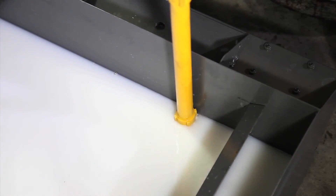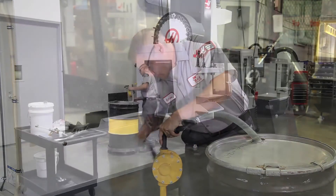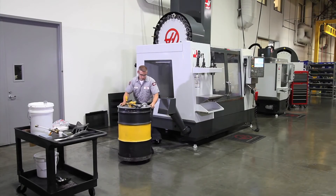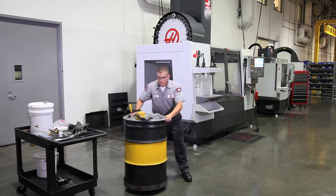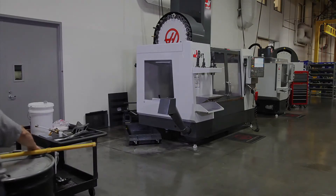Pump out the rinse solution. Your coolant tank and plumbing are now ready to be recharged. Remember, if you keep your coolant tank clean and your coolant chemistry correct, none of this extra work should ever be necessary. Please check out our other coolant videos that deal with making a new charge, topping off an existing tank, and the tools of coolant. Also check out our overview of coolant maintenance. Thanks for watching.